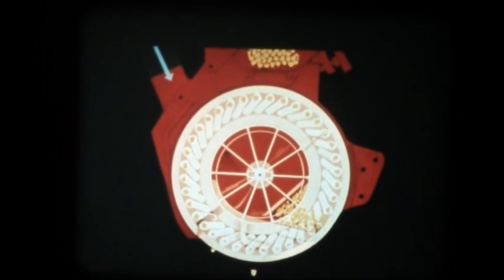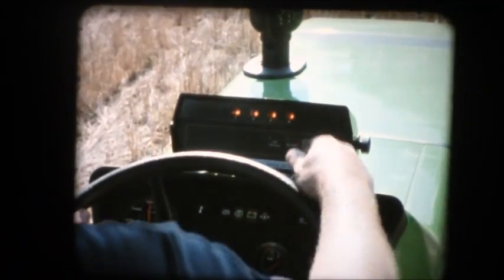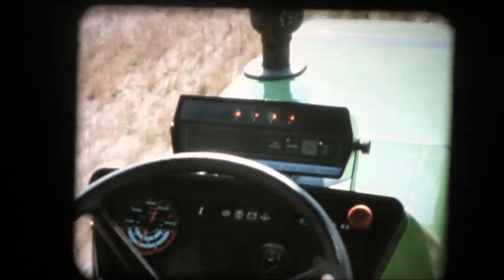After a seed has entered the rotating plastic disc, air to that seed is shut off. Then that seed has a natural gravity drop to the ground. This short drop is through an angled tube that reduces seed bounce for more accurate placement. With air singulation, there's no need for an expensive high-pressure hydraulic pump. Instead, the tractor's electrical system supplies power for the 12-volt fans. Air singulation requires no dials or gauges — simply turn the electrical supply on or off. The rest is automatic. The system is easy to maintain and simple to operate, providing very gentle seed delivery even when planting at higher speeds.